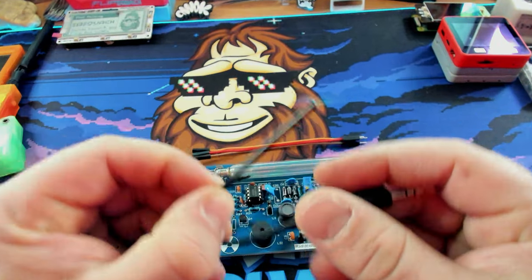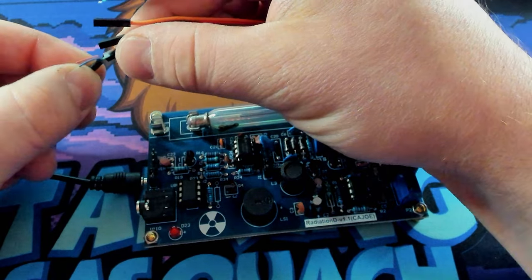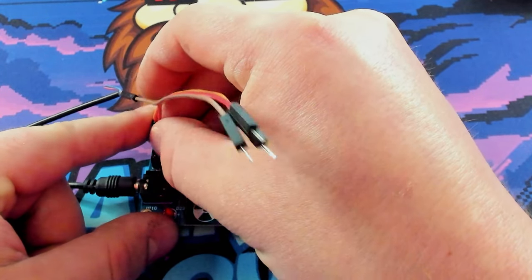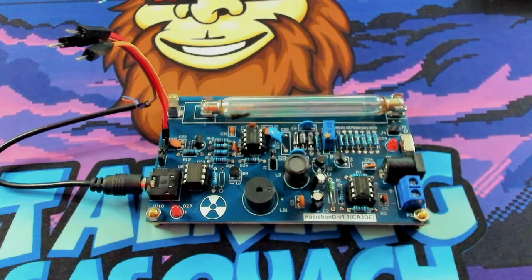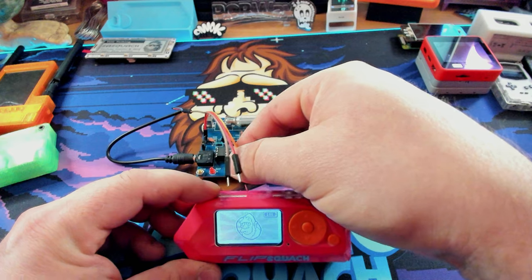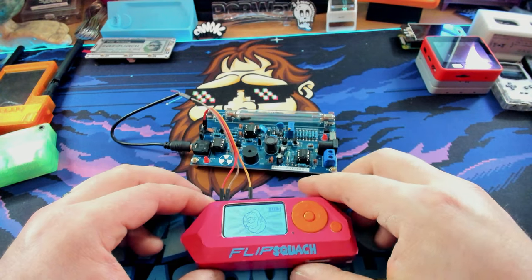With this mini jack, I've got the wires stripped out here, and I've got just the green wire — that's just a single channel. We're going to plug that into the brown connector here. Just jam that in there for now. And then we're going to plug in the audio connector. We're going to use the next two wires — the top one is ground, and the red one is going to be our five volts. Let's carefully get those plugged in. It's always harder to do when you're doing things on camera. Now we've got that, we're just going to grab our Flipper over here. We're going to plug ground into ground, and the five volt into five volt. And then we're going to plug the signal wire into the one right next to five volt. And now we're ready to go.